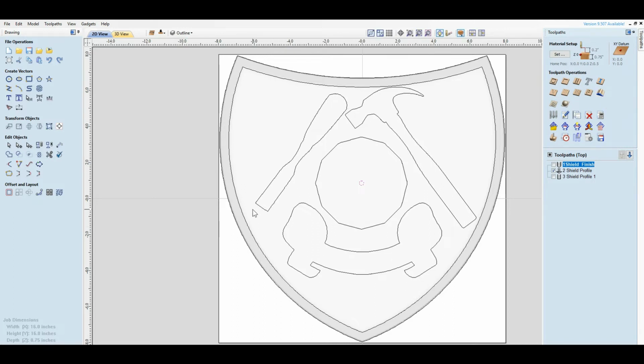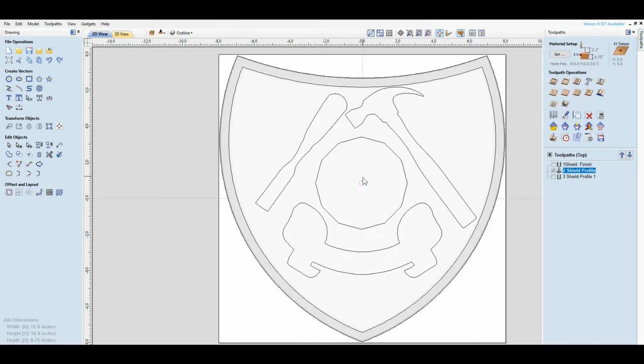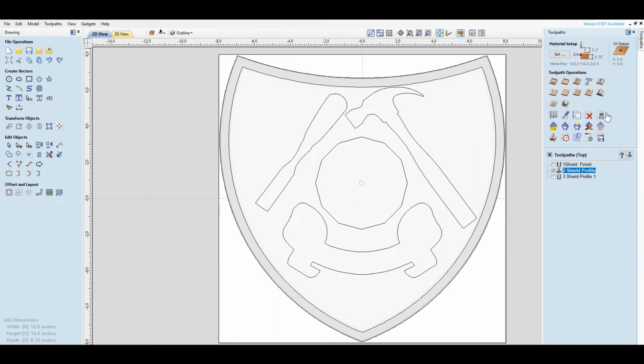You don't have to draw these toolpath outlines. The only one that I do is this one here. And the reason being is it centers up my clock face to my mechanism, so I'm sure it's going to be where it needs to be. So the other thing is that you can either drill this hole with the drill, or you can have it drill through with a bit on the CNC. The choice is yours. I usually drill it with my hand drill. It's not a big deal. But everything is centered on that hole as far as from one side to the other.